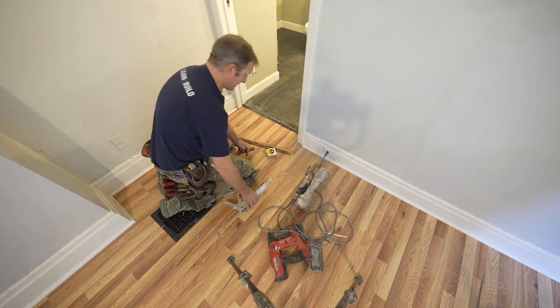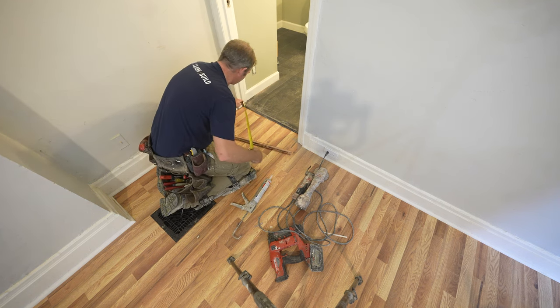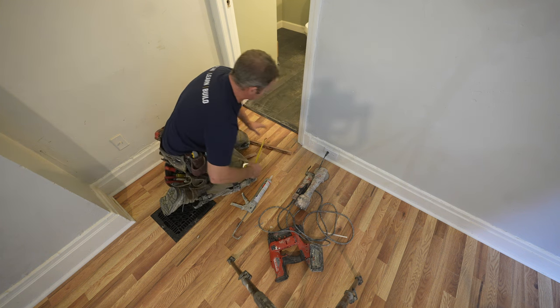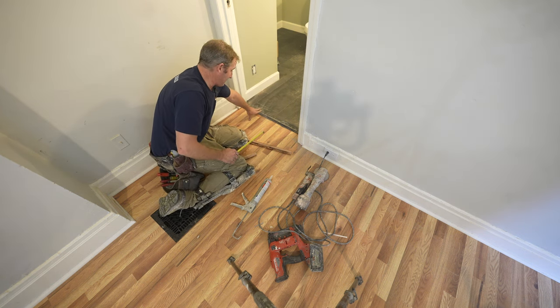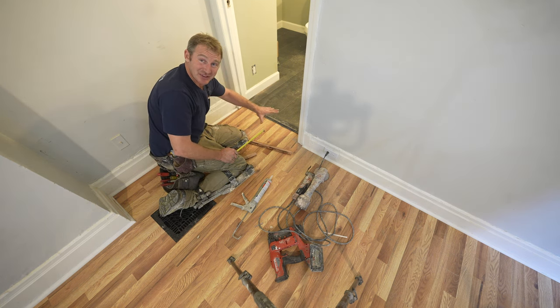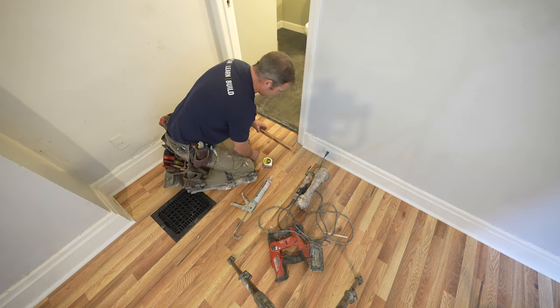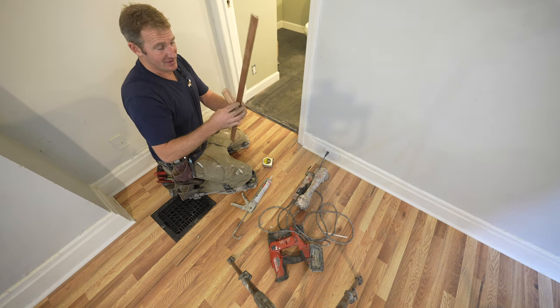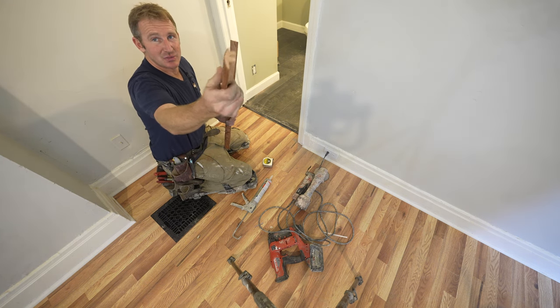All right, so nothing fun about a 1-inch transition. This is basically 1 inch off of my laminate flooring. Basically, I had a 1/2 inch plywood, an uncoupling membrane, and then the thick slate tile, so I ended up with an inch overhang. What I did was modify a transition strip here.